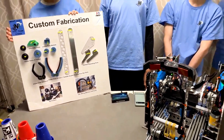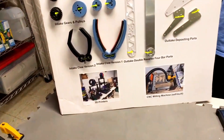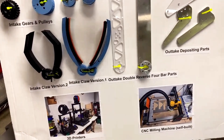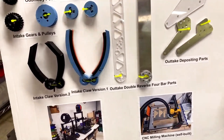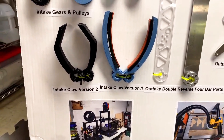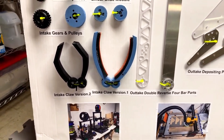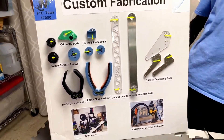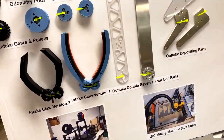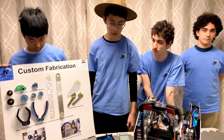I see you guys have some claw iterations over there. What was the reasoning behind switching from the much longer claw in blue to the current shorter design? The blue design was actually the first design we made this season. While it did grab the cone sometimes, because it was so long, if the cone was grabbed towards the outside of the claw, the cone would often slip and fail to transfer. That led us to a design with small pincers at the front to funnel in the cones, but also making sure that the part actually grabbing the cone was much closer to the pivot, giving it more force.